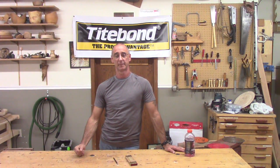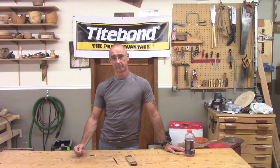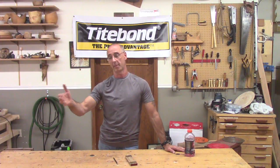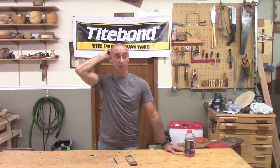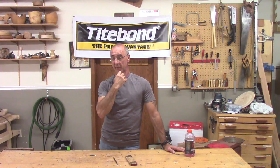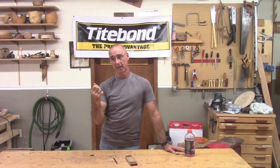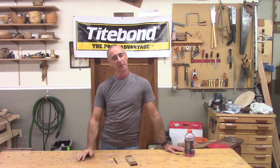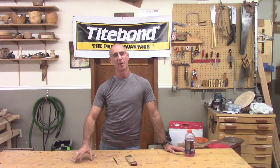Okay. Candace says, I'm wanting to make some countertops in my kitchen from wood. Do you have a suggestion on the type of wood I should use and the type of finish I should use to make it food safe? Well, maple is a pretty common choice. And if you go to a butcher shop and you look at the cutting boards and everything they have there, they're most commonly hard maple. So hard maple is a great choice. It has very little porosity, which means it's not gonna soak up a lot of schmutz that might end up on your countertop. For a finish, I don't know, that's a tough call.